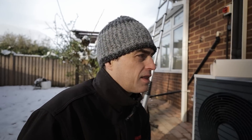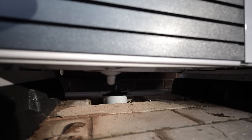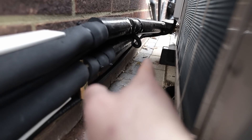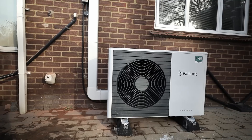There's a trace-heated element going inside the four-inch pipe, and inch-and-a-quarter waste pipework connects the heat pump outlet into the four-inch pipework. On the back of the unit we also have one anti-freeze valve on the return pipework at the lowest point — that will open if the temperature drops below 3°C and drain the unit from water to avoid damage to the heat exchanger. We also have a couple of flexible connections so that any potential vibrations from the unit are not transferred back through the pipework to the building.